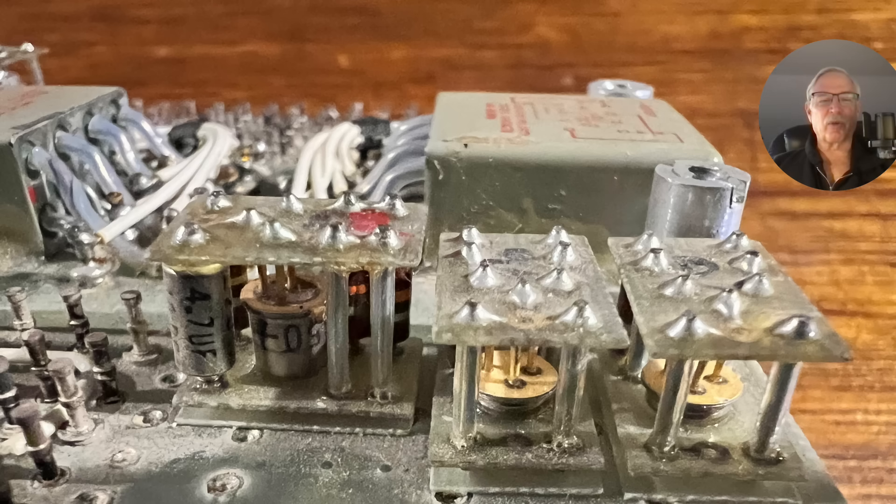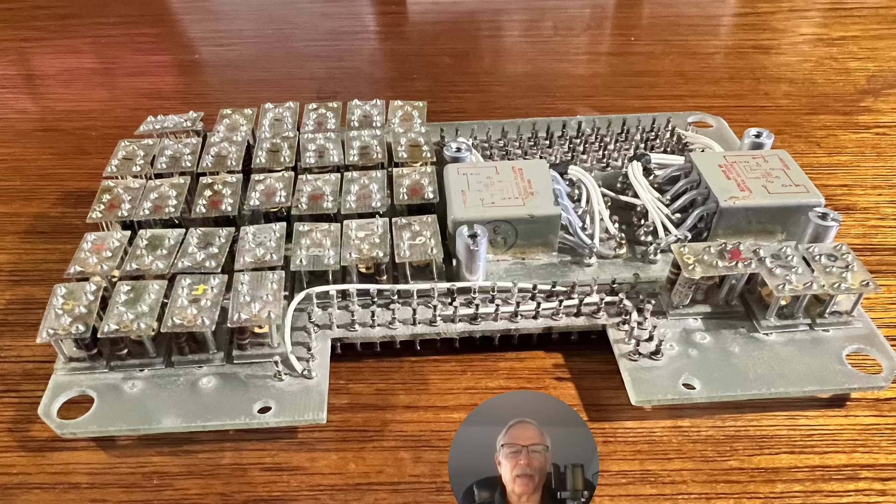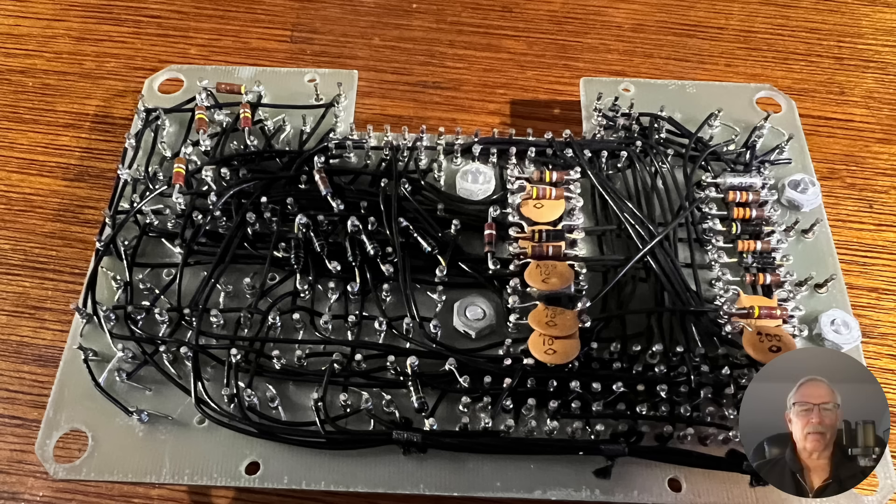Here is another view of the same thing, and here's a cluster of them on this board. This went as part of the LEPIDEA Project experiment — I believe that stands for Low Energy Particle Electron Differential Analysis. Van Allen discovered, quite coincidentally, the Van Allen radiation belts. This was one of many in a stack: these things were stacked, and you can see the holes for alignment pins. About six or eight of these were stacked in a magnesium box machined out of a solid piece of magnesium for strength and lack of joints.